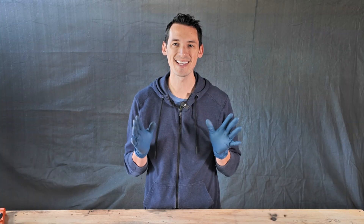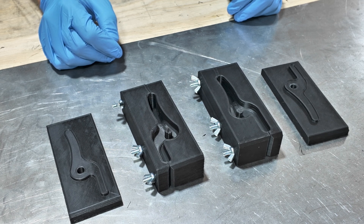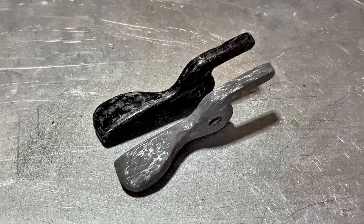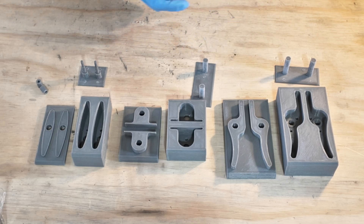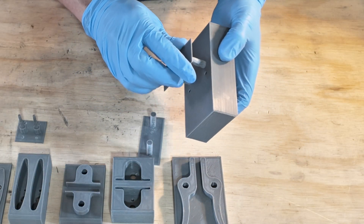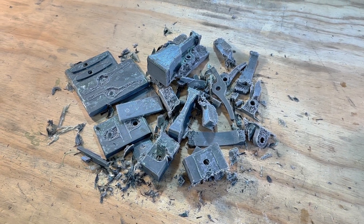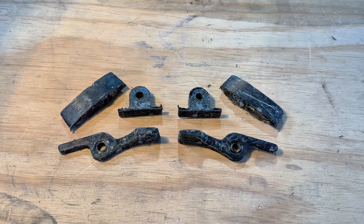Now let's talk about how I tested out different molds. The original mold was a three-part mold — one side split into two parts and then had a top cap. This worked pretty well but I still destroyed the mold taking the parts out. For the second mold I created a double mold for each part, used five degrees of draft on all parts, and added ejector pins with the hope that I could push the parts out. It was a total disaster. But after a bunch of work breaking these molds apart I was still able to get some solid parts.